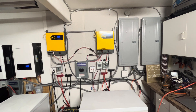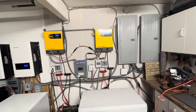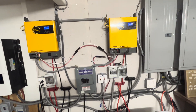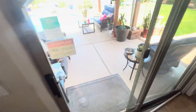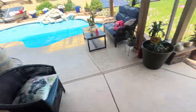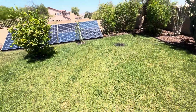I'm only getting about 112 watts out of the used poly panels — that's only 44% of the 250 watts. So that's a huge disparity. Let's go outside and I'll show you those solar panels. Right now the polys and the mono bifacials are pretty much getting full sun.